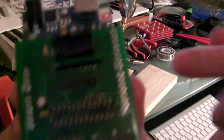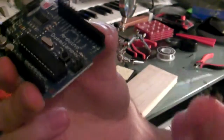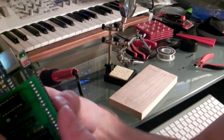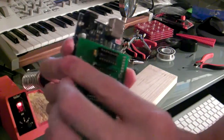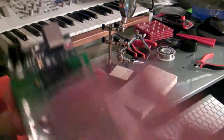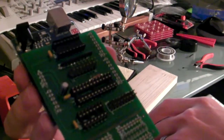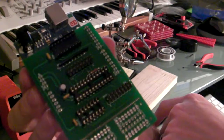So now you can see I haven't soldered them yet, but this is a case where instead of soldering on the back of the PCB, I'm going to solder to the top here. If I pull these apart, you can see I've got all the headers plugged into the Arduino board — they just come out very easily, just give them a tug. And then you get a separate piece. So I'm going to take all these out and solder them onto the shield PCB. And then once it's done, it'll all fit together very nicely. I'm going to put solder along the top here and along the top here, and that'll make the shield. I've still got the ribbon cable and some other components to build, but for the shield, it's just that and then plugging in the integrated circuits into the sockets once those are ready to go.